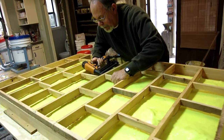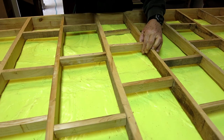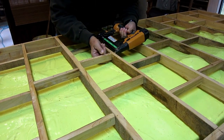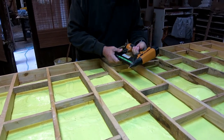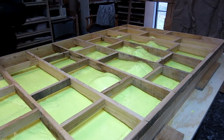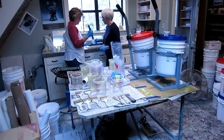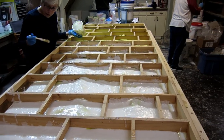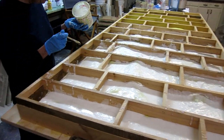The yellow rubber mold, when it's removed from the original clay, will be very floppy. So it needs a support in order to pour a permanent one in it. It's called a mother mold. We use two-part plastic, and in order to keep from using 400 pounds of plastic, I build a wooden frame to support it so the plastic can be in a thin layer.